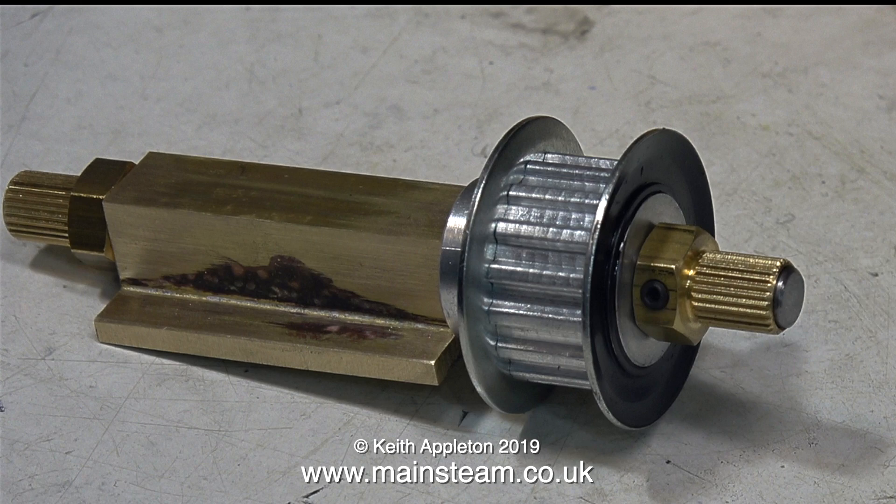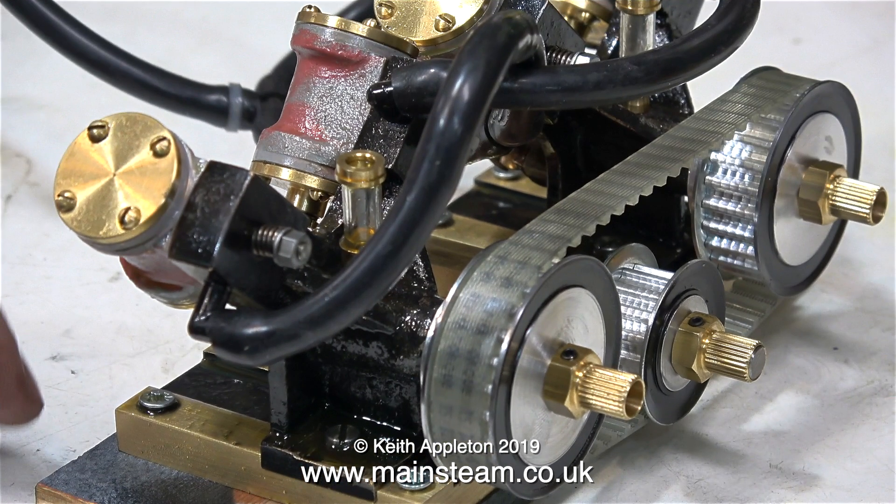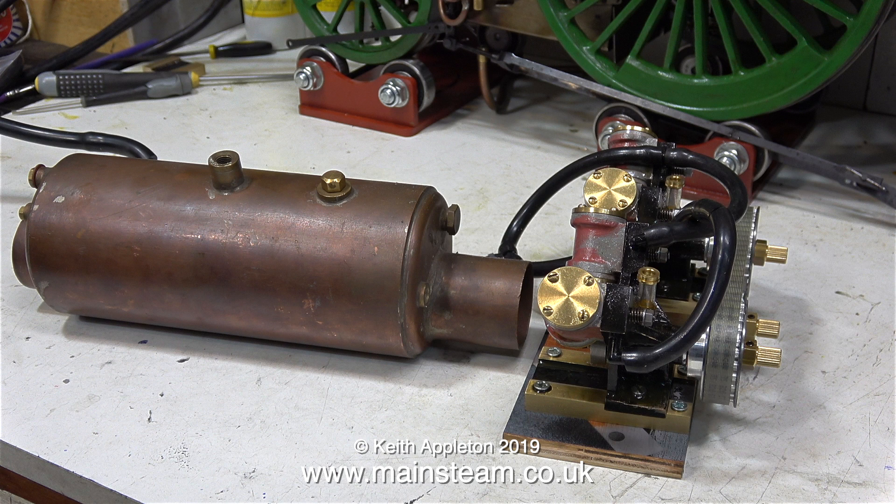Here's the general arrangement — this will fit right in the centre between the two main drive pulleys. The centre part of the baseboard will be made from metal, much thinner than the wood I'm currently using, and the thickness of this centre spacer piece will determine how much pressure is put on the belt by this centre pulley. In reply to the viewer who was concerned that the small surface area of the pulley touching the belt might cause slipping — as the pulley itself is the belt tensioner, this shouldn't occur. Because the engines are side by side, this won't take up much room in the boat, allowing for a much longer, larger boiler. This boiler by the way is far too small — it's just one I have in the workshop; one day I'll get round to doing a series about putting it together.